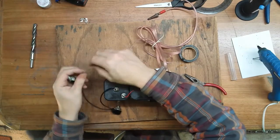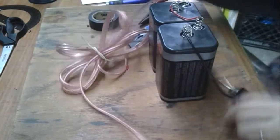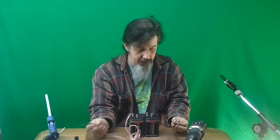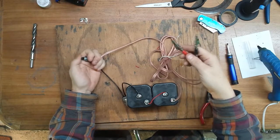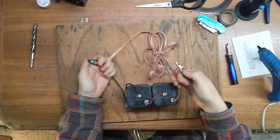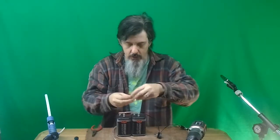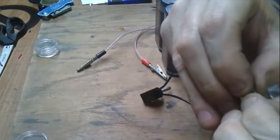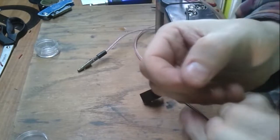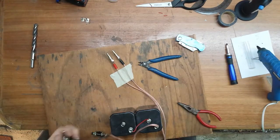Let's close the circuit and turn this to make sure it's in the off position. My circuit is complete. When this is in the off position, pulling the switch should do nothing — and when it's in the on position, pushing the switch should apply 12 volts across these alligator clips. Now it's a perfect time for testing. One of the things I'm going to use this for is nichrome wire — this piece comes from a hair dryer, it's the part that heats up when current is applied. Very thin, very strong, very high resistance wire. I pull off a piece about an inch long.